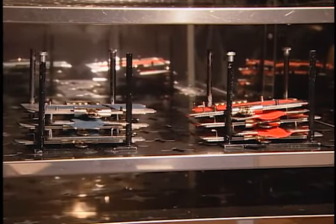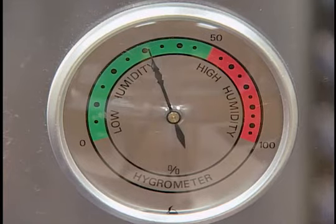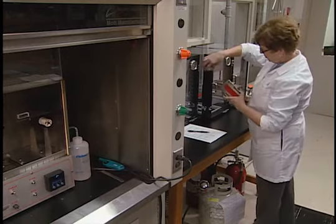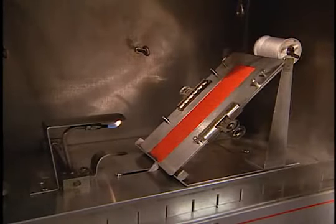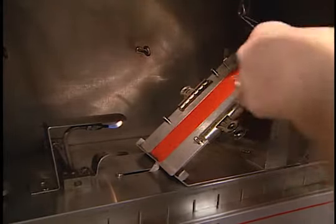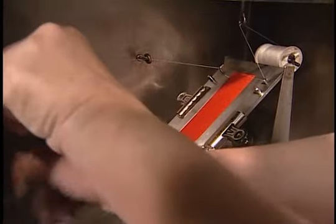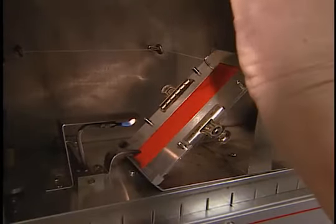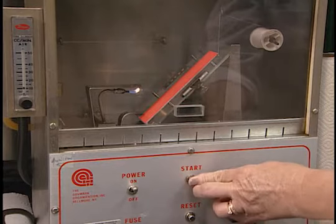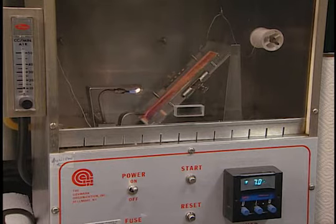Racks holding the framed, brushed specimens are put into a circulating air oven set at 105 degrees centigrade for 30 minutes. Once removed from the oven, the racks are moved into a desiccator where they are cooled, but no humidity is added to the specimens. One specimen at a time is removed from the desiccator and immediately placed on the inclined plane assembly inside the test cabinet. The cotton thread is pulled through the guide on the upper frame to secure it in place across the specimen at the upper end of the specimen holder, and a weight is attached to the thread. The chamber door is closed and the start button is activated to begin the test. If the flame starts a burn and continues to the top of the specimen, when the thread breaks it drops the weight, which stops the timer and ends the test.